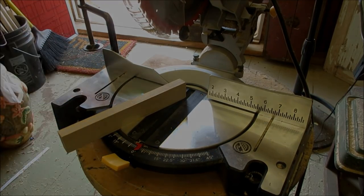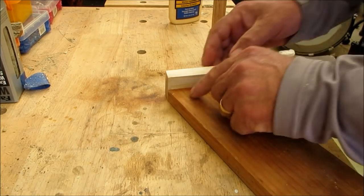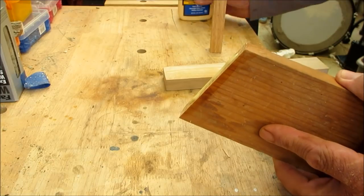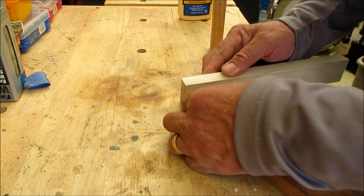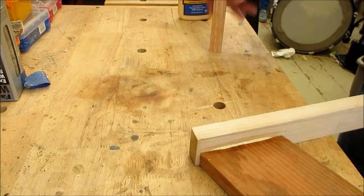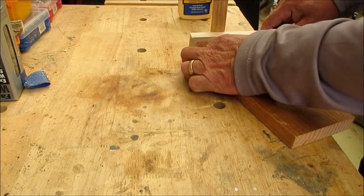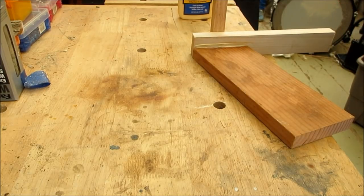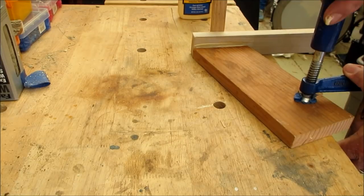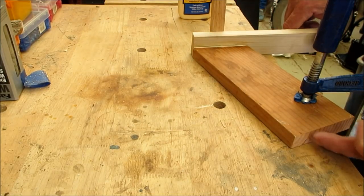It's been my experience that if I try to put screws in right now, it's not going to line up right — I need this edge to be perfect. So I'm going to put a little bit of Titebond on this board and get everything lined up. Those round holes and pegs on the workbench are handy for rotating and positioning. I'll put that angle right against there to make sure everything meets exactly where it needs to be, then clamp it down like so and let it dry before adding screws.